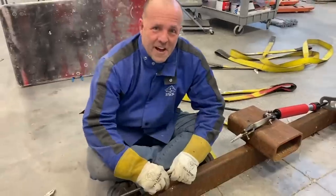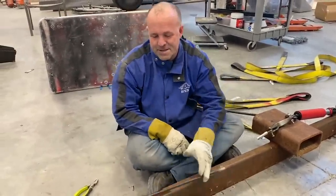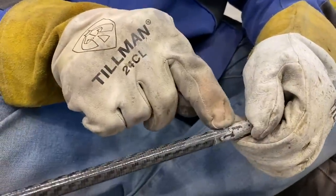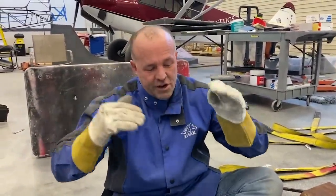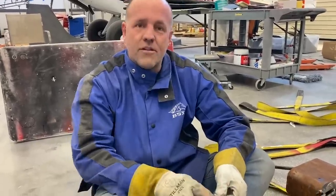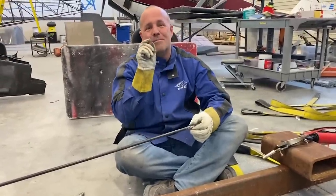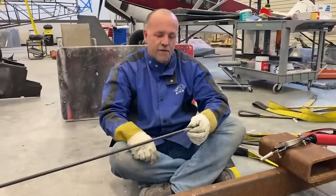All right, guys, so where did it fail on the carbon fiber? Amazingly, not the carbon. Absolutely held up. So the fail point was the bond joint and the rivets themselves, and the rivets didn't pull out. You can see that. What happened is the rivets hit ultimate shear and just sheared. What's really amazing is that I see no signs of carbon fiber even fatigue, bending, flexing, which is why I filled it with a micro and a resin in the middle, to help absolutely embed the backside of that rivet while it was wet and let it harden around it so it wouldn't move.